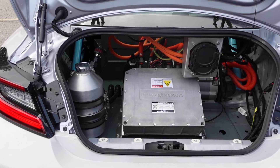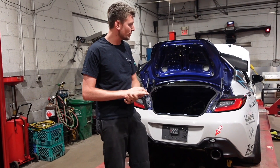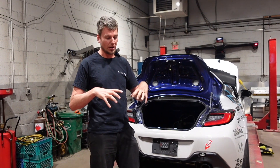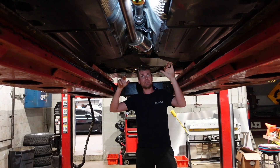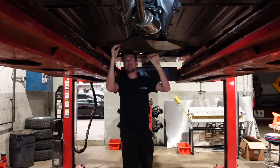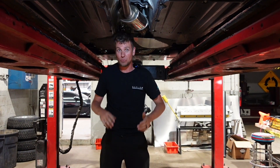We're also going to experiment with having some cooling come up through the trunk and some aero into the trunk through the back for cooling the motor. Our inverter sits back here — it's a little heavy, about 30 pounds — and it's really the only thing sitting behind the rear axle, along with our dry sump oil tank, since the motor is dry sump cooled and lubricated. So almost all the weight is either on the axle or between the axles. Standing underneath the gas car, you'll notice a lot of bumps and uneven surfaces — the transmission tunnel, exhaust routing, many different height levels.